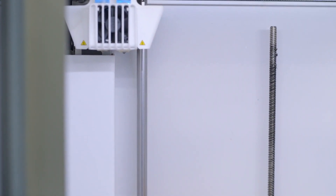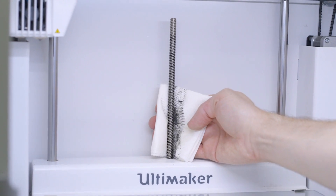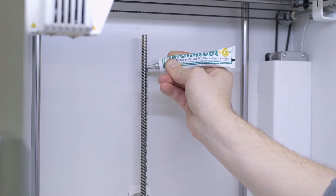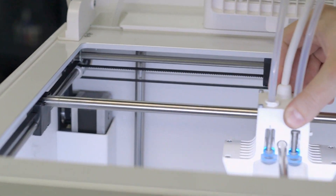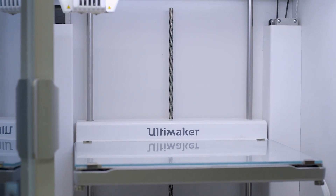You'll also want to clean the two Z-axis steel rods and the lead screw that lifts and lowers the bed. Expect the paper towel to pick up quite a bit of dark grease and it may take more than one pass to fully remove it. Once it's removed, use the lubricants provided with your Ultimaker. The Unilube oil should be used for rods and the green Magnolube should only be used on the lead screw. To avoid over-saturating the moving parts, add a few drops and move the gantry and bed to spread the lubricant around — you can do this by hand or with the LCD.